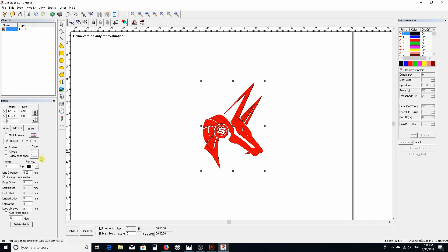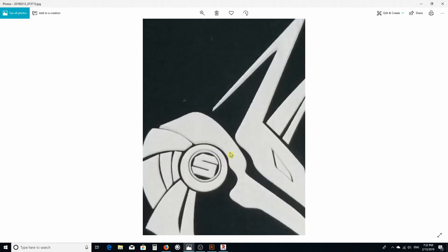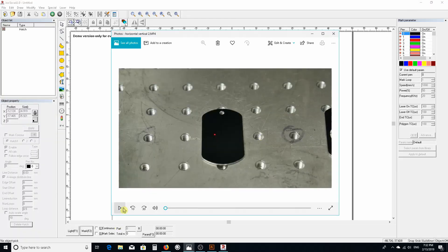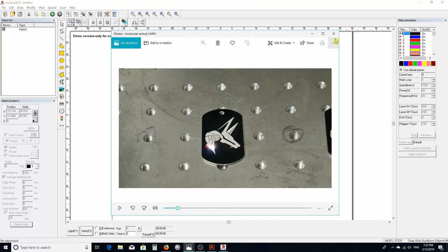On the final product you want the engraving to be super clean, but with the zigzag hatch pattern there's a problem. You can see a vertical line here, a horizontal line here, another vertical line — that's because with the zigzag pattern it can't clean the whole surface in one pass; it has to break into sections. You can see where it broke the pattern, leaving visible dividing lines. This didn't look real good.